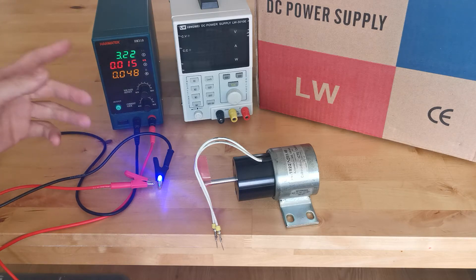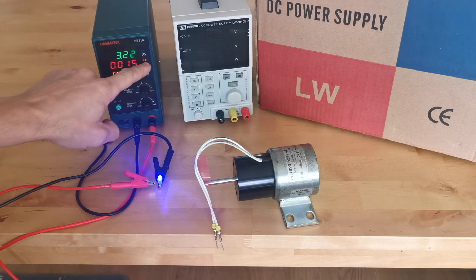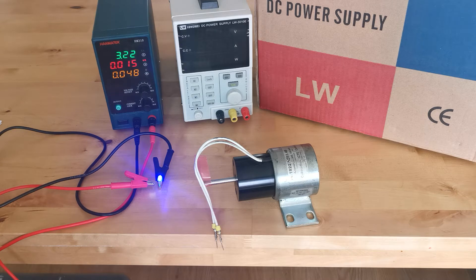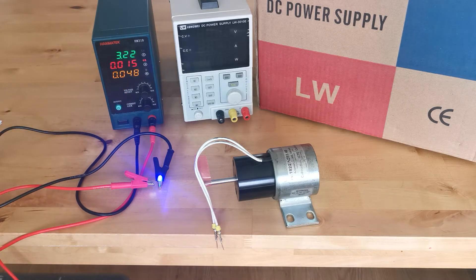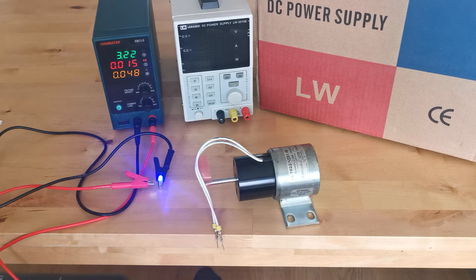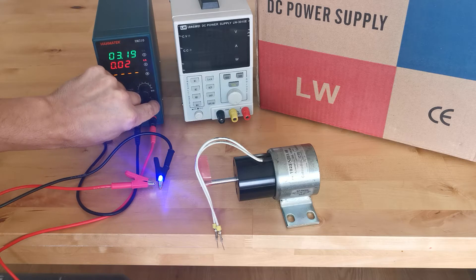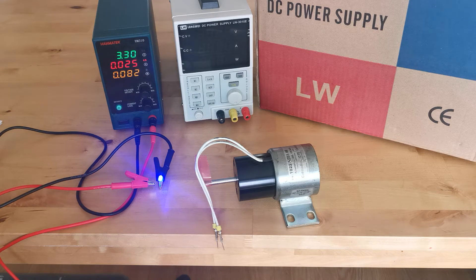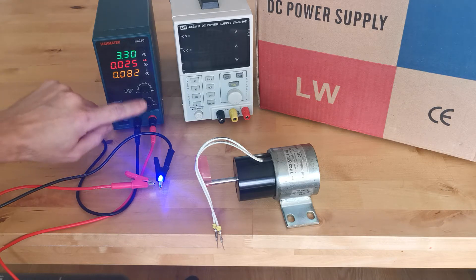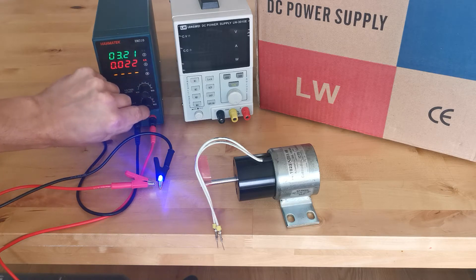On the load it's working, but it's showing 15 milliamps and it's in constant current mode. Constant current mode means it's limiting the current, but my current setting is 20 milliamps, so I think it's just an error in the current measurement. I measured the current with a multimeter on a higher range and didn't have much of a problem. At 25 milliamps it shows 25 in constant current mode, so I still have control.